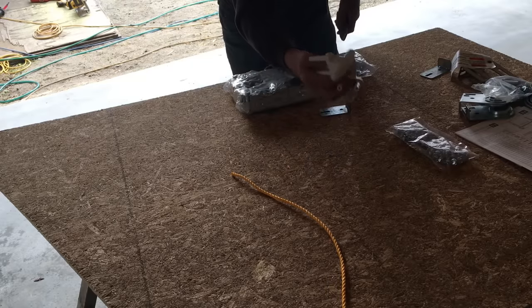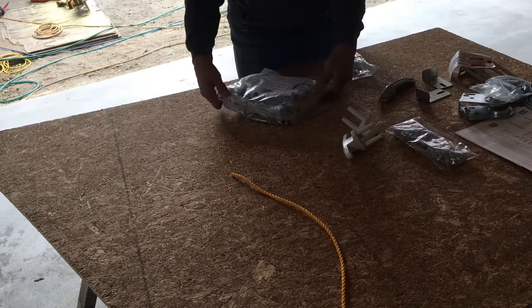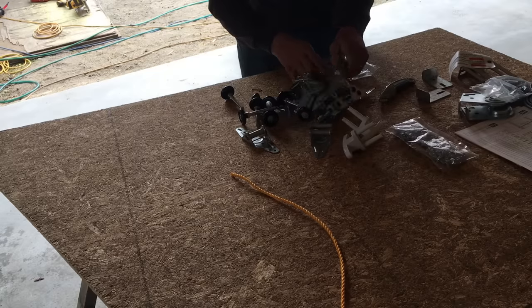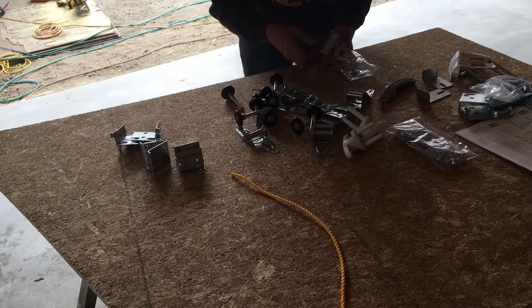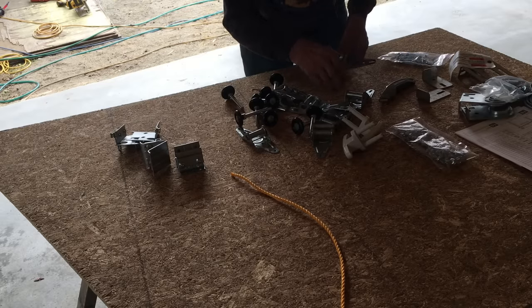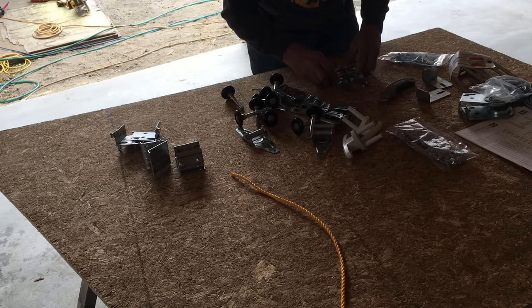So this is generally where I start. I've got two door handles, two inside latches and handles. It's pretty tough plastic. These are the bottom brackets — they just break apart. Even with my wrist hurting, there's a left and a right for those. Two top brackets for the doors. These hinges are numbered. They have a number three. For a seven-foot-high door, there'll be a number three, a number two, a number one, and then the top and bottom bracket. They don't punch the numbers in very well, but I'm pretty sure those are both threes.